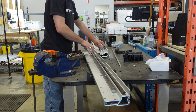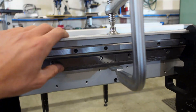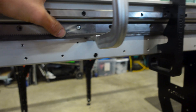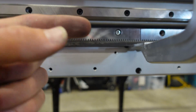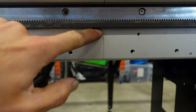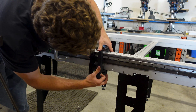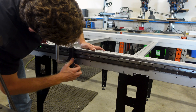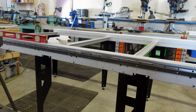The two pieces — racks and rails — should be aligned with respect to each other. We've got the table in a half state of assembled. What I'm doing is joining them now. I've got this intermediate third rack that I'm clamping into the two racks, which has seemed to pretty well work with what I was expecting it to do. The angle of the teeth, when they're not aligned axially, when you push up there'll be a force in the axial direction which closes this gap. Looks like the gap on the rail is pretty much none — it's zero, which is great. Throw a bunch of these on. Throw a linear guide along it. Let's see how it goes.